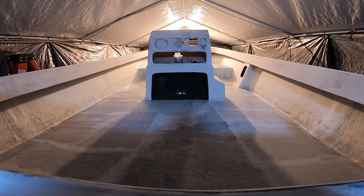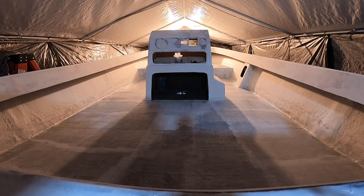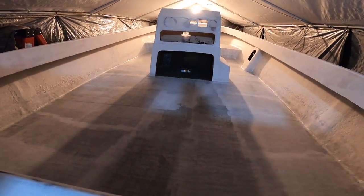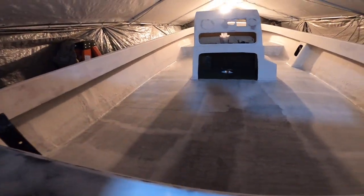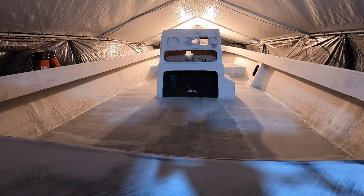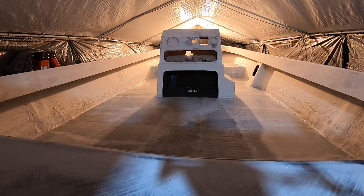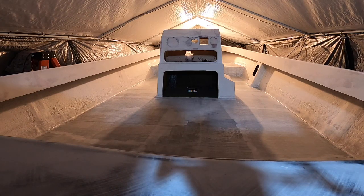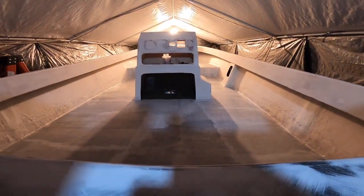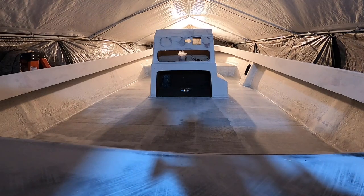That took my entire life using a 4-inch mohair nap roller. There's still a lot of show-through, though that's just a shadow. I did my best to keep these lines even. I've got quite a bit of paint left over so I think I'm going to put another coat on the floor to fill in some of those less covered areas where the paint started getting thin. I figure the more primer the better — creates a better bonding surface. I'm satisfied. It's all white, it all blends. You're going to see the imperfections in the floor and the ripples in the sides, but it's uniform, which is great.